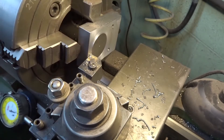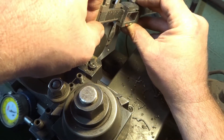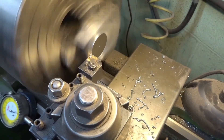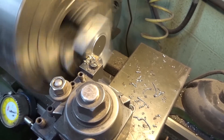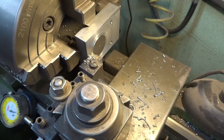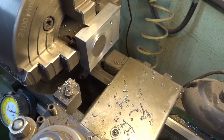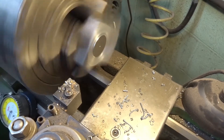You can kind of see what it's going to look like. We need to measure that. That dimension is supposed to be 1.2 inches and we're at 1.4 right now. That's 1.231, so I'm going to set that as my stop and we'll clean that up later. I'm taking relatively light passes here purposely.